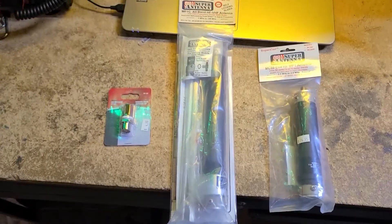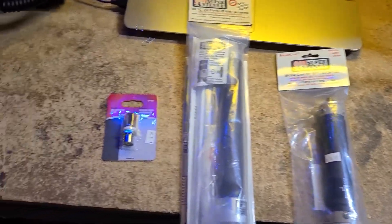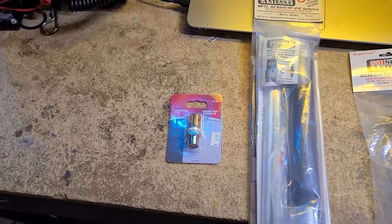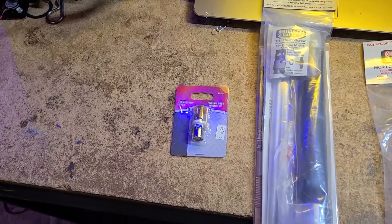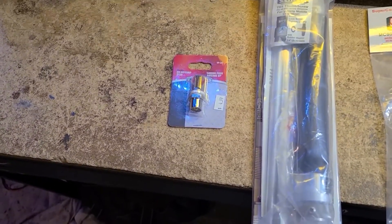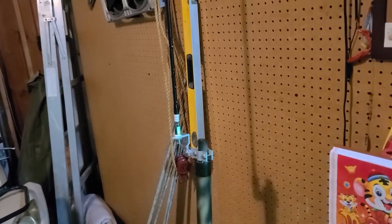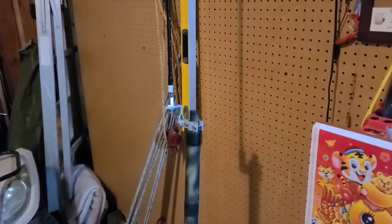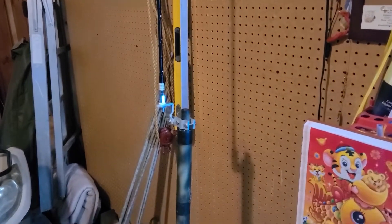This is the main antenna body here. Over here to the right is the resonator for 80 meters and 75 meters, and then there is an antenna stud. I went and purchased a couple pieces of thin Lexan, and I'm going to drill a couple holes in that and mount it to a camera tripod, then put the antenna stud through the Lexan. Or I may attach it to this telescopic mast that the hamstick is currently attached to — it extends out to 15 feet, and that added height might really be a good choice as well.